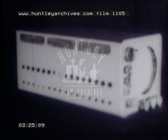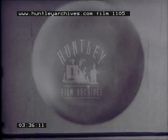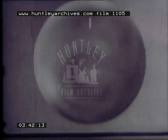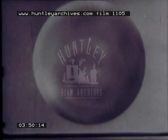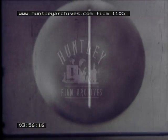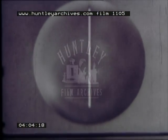This cathode ray tube is so made that we can get a small spot of light on the tube face, and make this spot move in any way we please over the face, and as fast as we like. So we make the spot of light move in a straight line up the center of the face, from bottom to the top, then very quickly back down to the bottom, and do it again. We make it keep this up all the time, at the rate of 500 times a second, so that what you see is a straight line, or trace, of light. This line is called the time base.